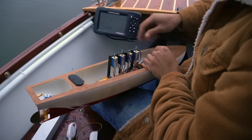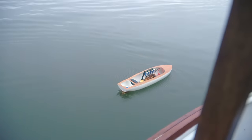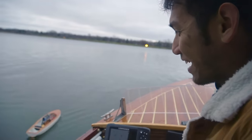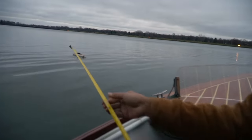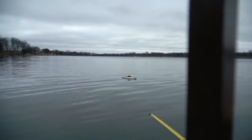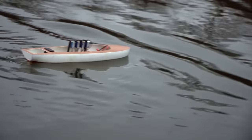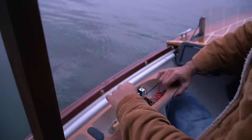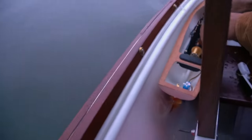Yeah, that's it. You just go ahead and leave. Go, boat, go! Look at it go! So it takes 22.2 volts to get anything useful out of it, and even then it's abysmally slow. Alright, let's see how it measures up. Oh god, feels like it's slowing down. I should grab it before it stops working completely. I think I see the solenoids discoloring. I can't tell if it's hot because my fingers don't work. Maybe the switch burnout. Well, the solenoids aren't too warm.